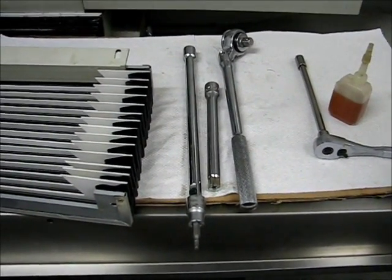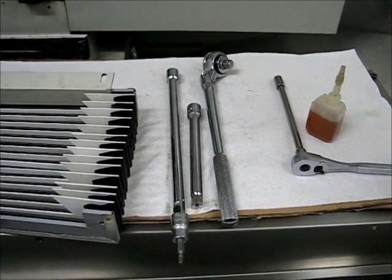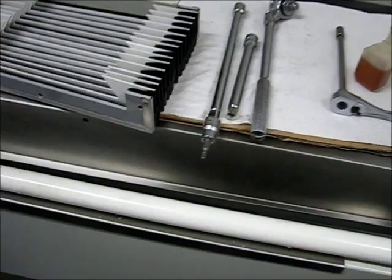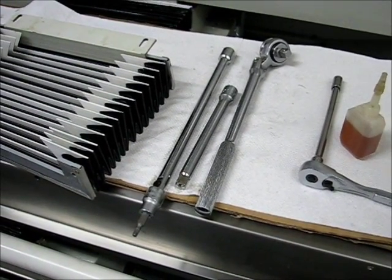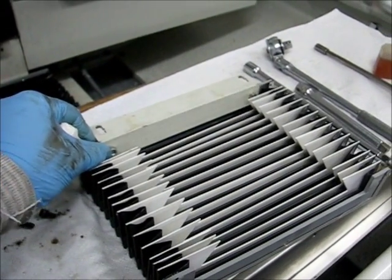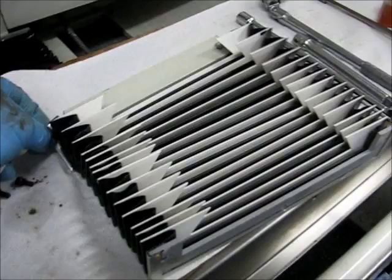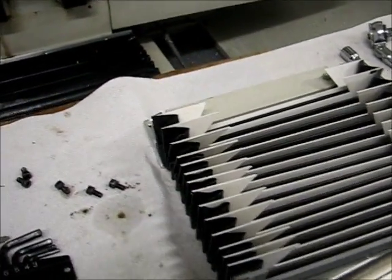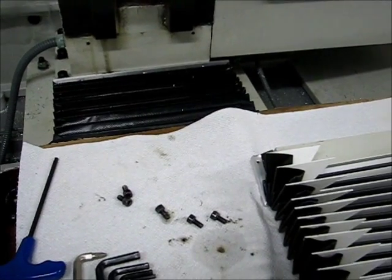I don't know what sort of materials I'm dealing with for the ball screw assembly, or the quality of the fastener thread form. So I wasn't convinced I should torque it too much — afraid I might strip something out. I gave them a snug, probably 20 to 30 degrees on each, and they easily took it — less than 20 foot-pounds of torque. Second, I decided to revise my assembly method based on what I learned taking it off. I put the angle bracket on before even installing the bellows cover in place — easier than messing with the whole nut assembly. Then all I have to do is attach the two screws directly into the casting of the column.